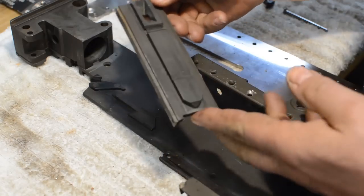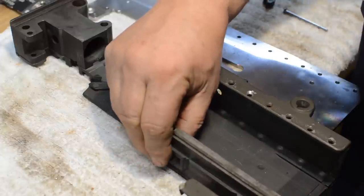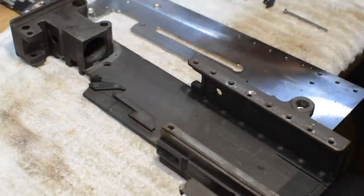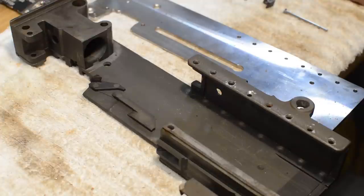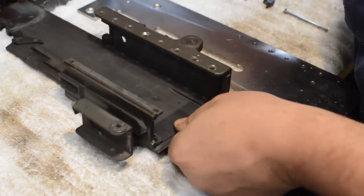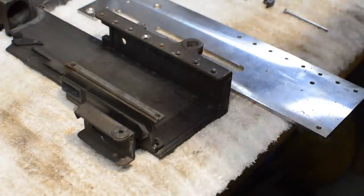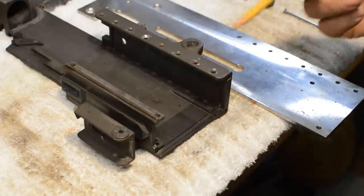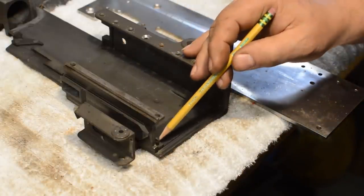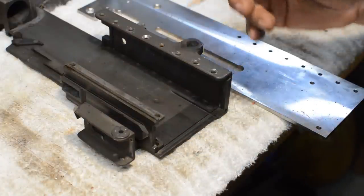This cover plate mounts in this position here in the side of this. And we had to make some custom rivets for it. There's a custom rivet that's going to be located... Where's my finger? Oh, there's my finger. Hang on a minute. Let me bring that up here where you can see it. We have an operational monitor now, so Bruno doesn't have to give me hand signals. Pull out a patent carbon sheath pointing device. There'll be a custom rivet inserted here, a custom rivet inserted here. We'll buck into the back, rattle that in.